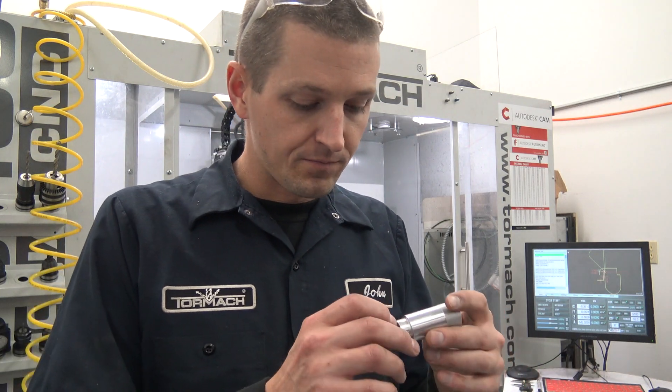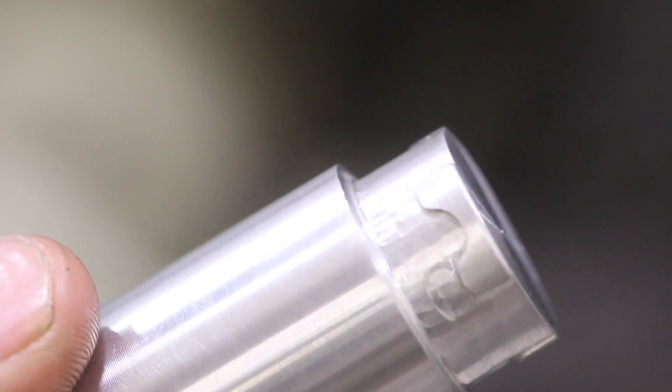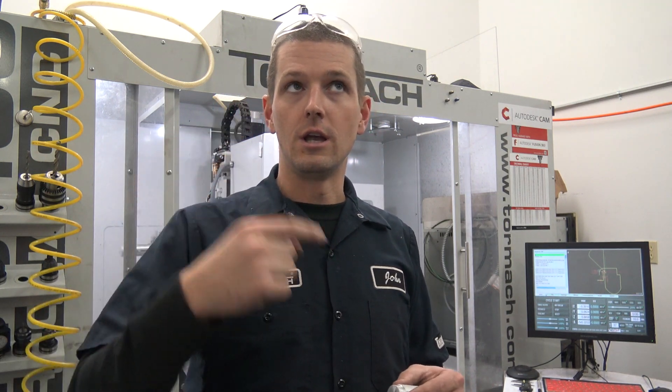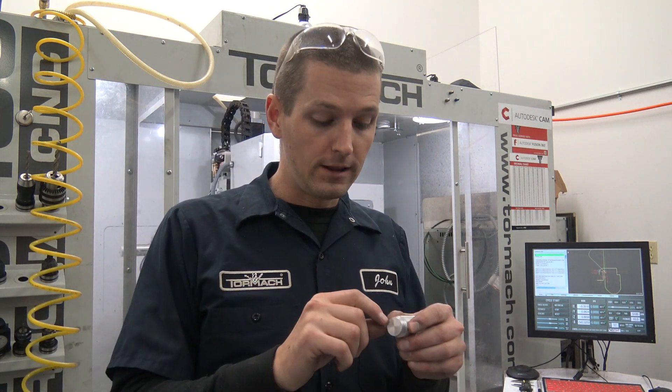But really cool. You can see — we'll zoom in here on the closer lines. You can see there's still faceting along it. The shorter those rotational step overs you do, the fewer. You could also change from that rotary machining from linear to the other direction and have it checker it, and that's going to further eliminate those facets if that's something that's really important.